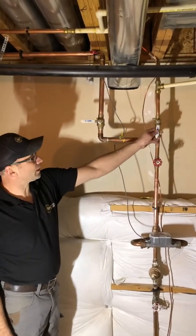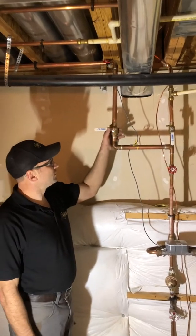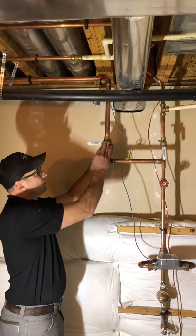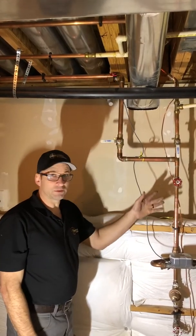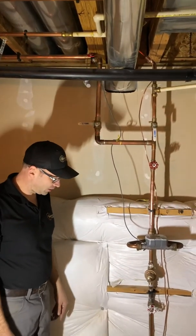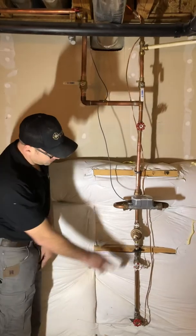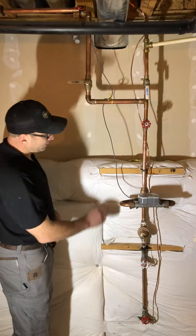You've got another valve, and this is what I call a vacation valve. Typically whenever you have a T coming across and coming up, this is typically your sprinkler. We're a little redundant on how many valves there are — typically there's usually one before the pressure reducing valve and the meter, so one is a little redundant.